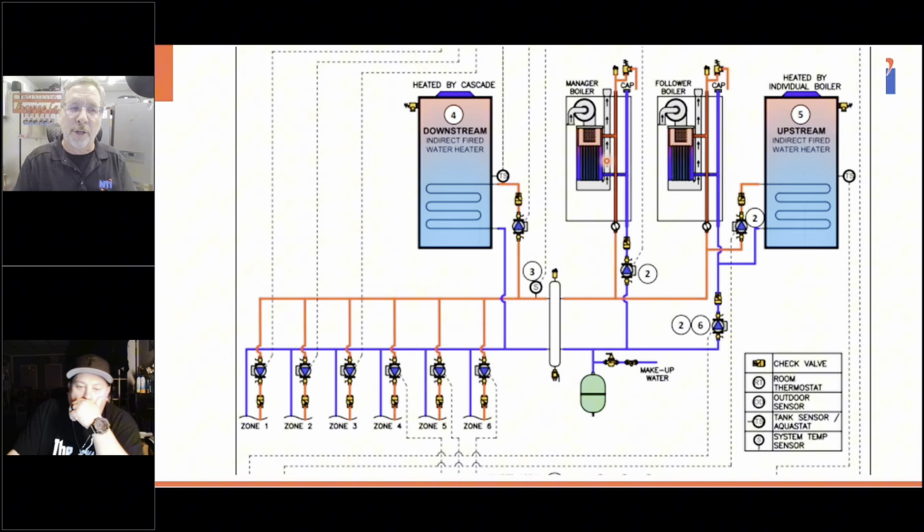So it's pretty cool to do. And these zones will shut off when the domestic calls. And when this domestic's done, the zones will come back on. Huh. So this is already done on the TFTN, but what happens when we have more than 6 zones?